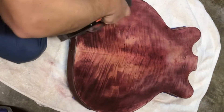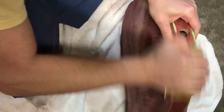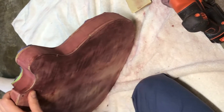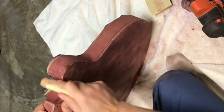Here, as you can see, my dad is raising the grain on the guitar with some of the denatured alcohol you saw earlier. After you put that on, all you have to do is sand it off like we did before. You should also sand the sides, and you can get into those crevices with a piece of sandpaper wrapped around a round object.